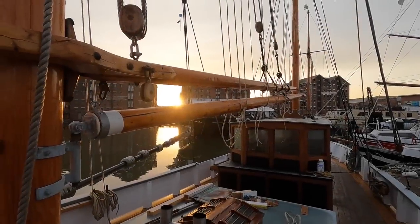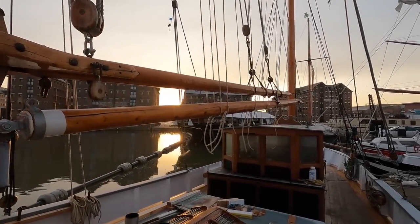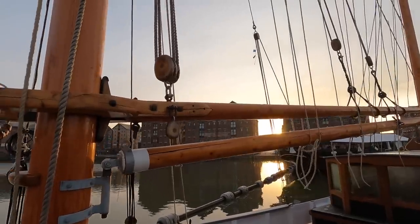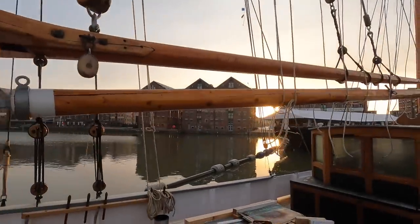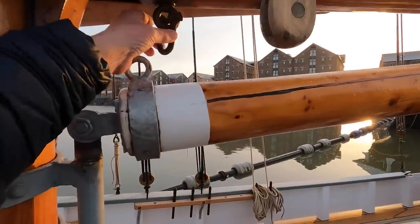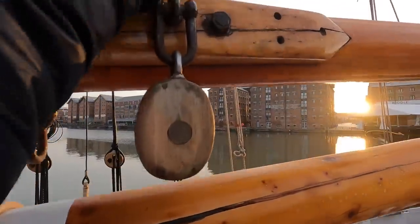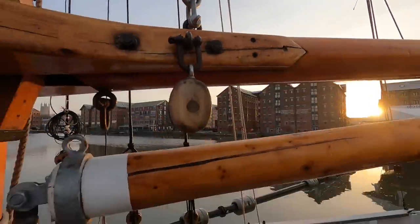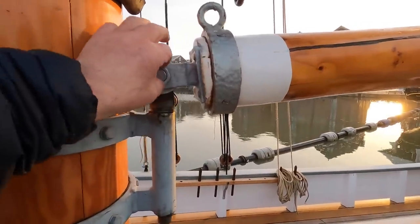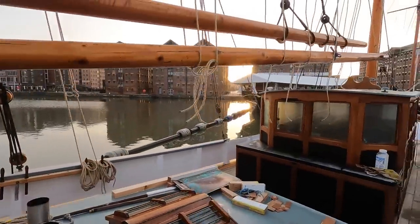The main is all done, really, I suppose. Have I? No, not the lazy jacks, but otherwise, yeah, boom, gaff, all done, all working fine, everything's okay. I haven't finished off, in terms of, I've got to replace, for instance, that shackle, and I haven't moused these shackles in case they had to come off again, so there'll be the little jobs, and I've got to drill a hole through there and put a split pin in that bolt there, in that nut,